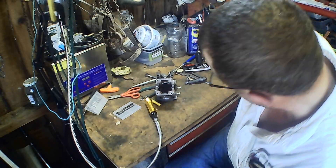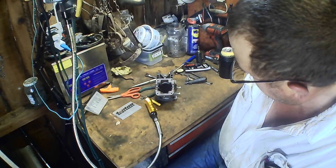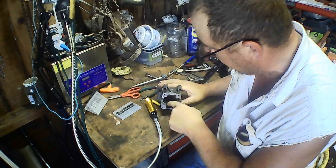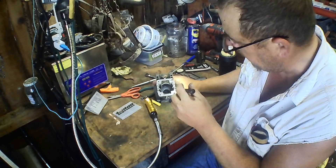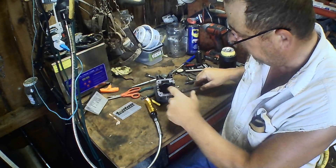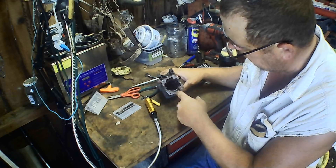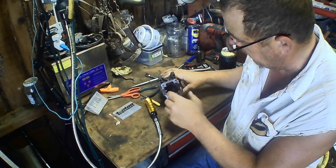One of the first things I do, I find my flashlight back out of my holster here. You can actually see that's shiny right in there where that air hits. That air's got to come around there. I'll blend this off, and I'll blend this corner here off. That's the first thing I'm going to do — where that air can get from the bottom end of this down here where the crankshaft's at.